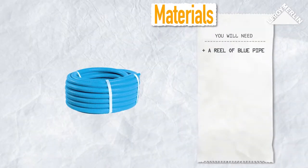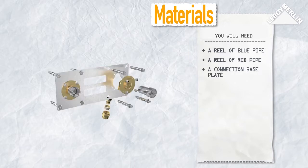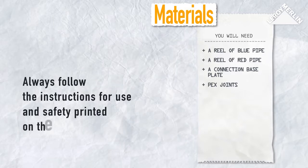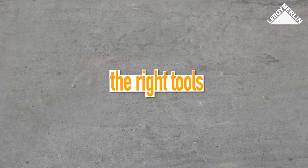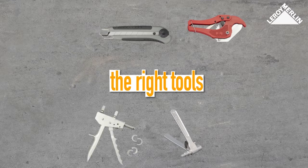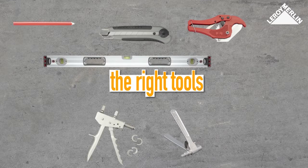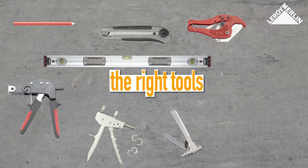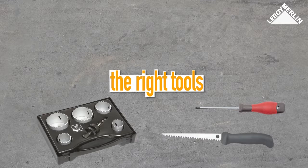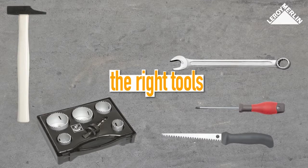You will need sheathed reels of PEX pipes available in blue for cold water and red for hot water, a connection base plate with 90-degree ports, cavity wall anchors for the base plate and PEX joints. You will need a box cutter, a pipe cutter, a PEX expander tool, a PEX sliding fittings tool, a spirit level, a pencil, a fixing gun for cavity wall anchors, a drill, a screwdriver and a set of hole cutters, a plasterboard cutter, a set of flat spanners, a hammer and a masonry bit.